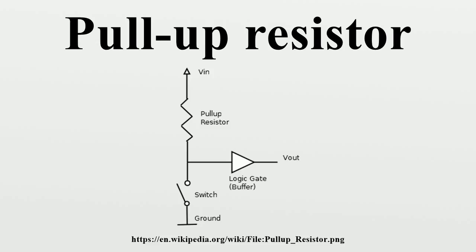If the input is left unconnected, pull-down resistor R1 ensures that the input is pulled down to a logic low. The 7407 TTL device, an open collector buffer, simply outputs whatever it receives as input, but as an open collector device, the output is left effectively unconnected when outputting 1. Pull-up resistor R2 thus pulls the output all the way up to 12V when the buffer outputs a 1, providing enough voltage to turn the power MOSFET all the way on and actuate the relay.